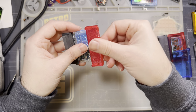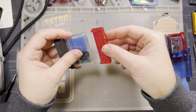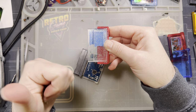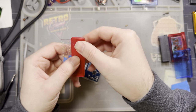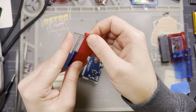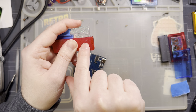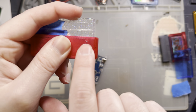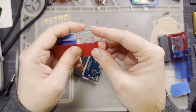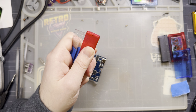Yeah, okay, there we go. I accidentally flipped the jig, see? Double check before you drill anything out, of course. Yeah, I had that right. You just drop it into the jig, top facing out, and then flip the whole thing over, and then drill through the hole on the bottom. It's kind of loosey-goosey. It'll kind of move around on you, so be careful. Make sure you have your work holding set up sufficiently so that this doesn't slip around. It is just plastic and plastic, so of course you can just hold it and drill through it, but I really don't recommend doing that.